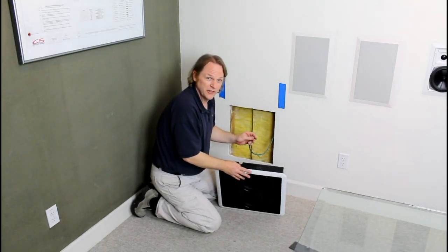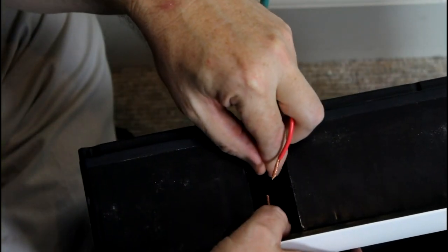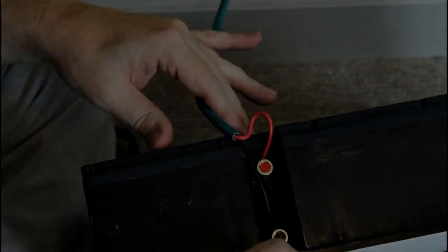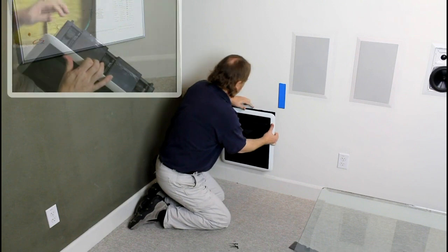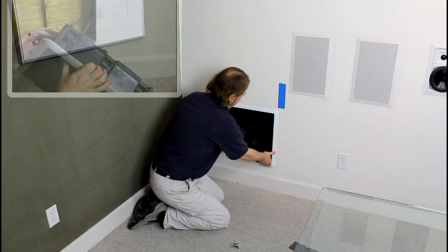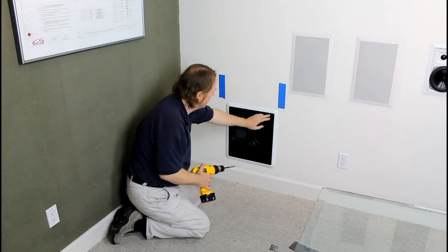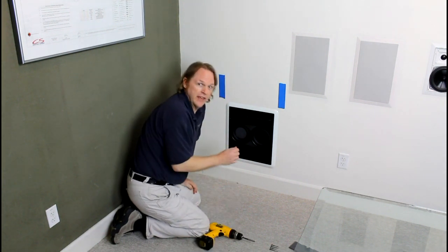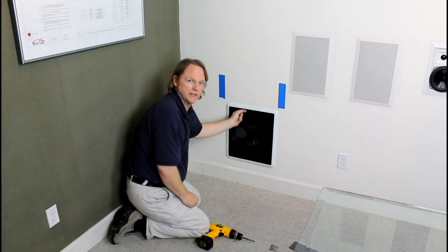You might want to put a little bend in the wire so it goes into the terminal a little easier — black to black and red to red. Now place it into the wall. Be sure the dogs are down so they don't keep you from being able to put it in. Then tighten up the dogs or clamps using the three screws at the top and three screws at the bottom of the SC600iW. You can use a drill or a hand screwdriver, just don't over-tighten. Recommended to start at the top and alternate top to bottom.